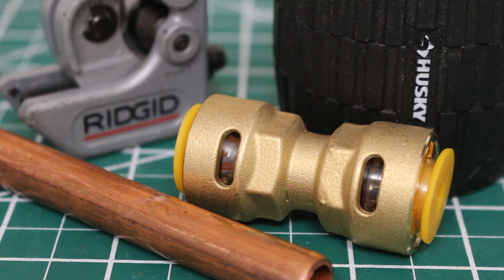There are many pros to this — not having to use a torch and things of that sort — but the cons are that they are a bit bulky and expensive. However, you are saving on equipment: no more B-tank, nitrogen tank, regulators, torch tips, or brazing rods. You're also not running to the supply house for gases — nitrogen, oxygen, acetylene. All that is time-consuming and expensive. And you no longer need that expensive crimping tool either. So you do make your balance there — it's up to you.